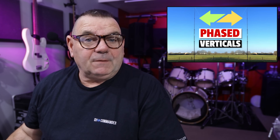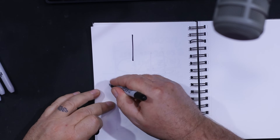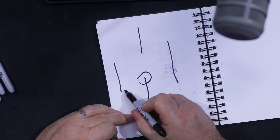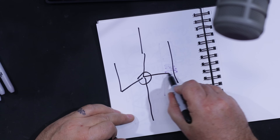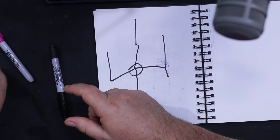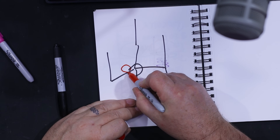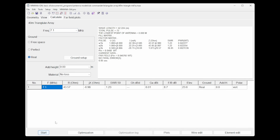We've got the phasing harness. You can do 45 degrees, 50 degrees, 60 degrees, or 75 degrees of phase delay. Sixty degrees on the math seems about right — you'd need to look at those two previous videos to understand the phasing line. Fundamentally, all we've got is three verticals — one, two, and three — with coax split to each. All we're doing is switching in an extra bit of coax on a relay: 60 degrees' worth.